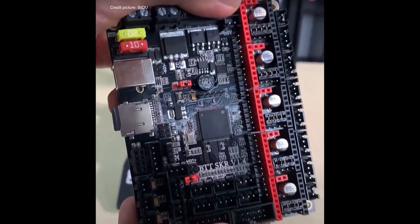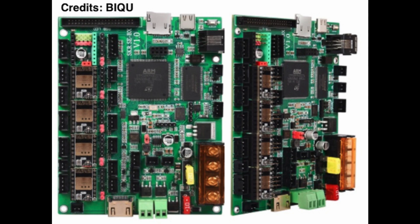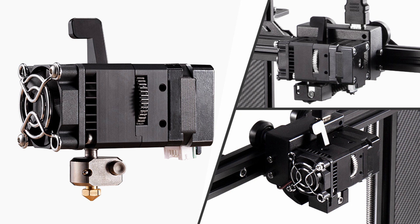BQ uses a dual stepper motor setup on the Z axis in combination with a timing belt on top of the BX. The heart of this brand new printer is a new 32-bit 400 MHz chip, which makes it more capable of complex 3D printing. Safety features include reverse plug protection, heat overload protection, and real-time monitoring of the power supply voltage. The direct drive extruder is very light, weighing only 219 grams — it's an all-metal extruder with a 7-to-1 ratio torque transmission for great printing performance.